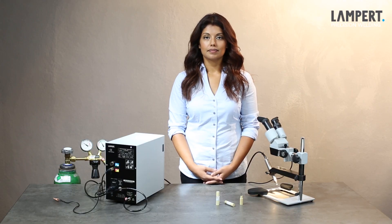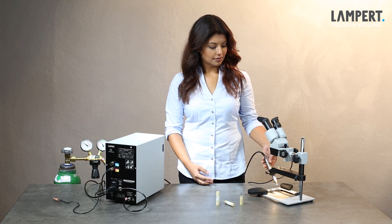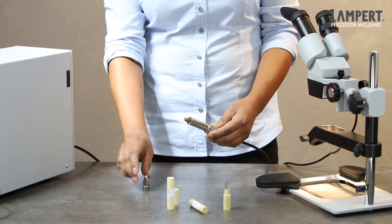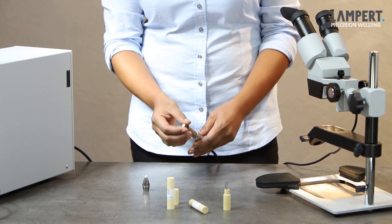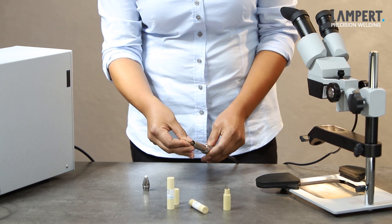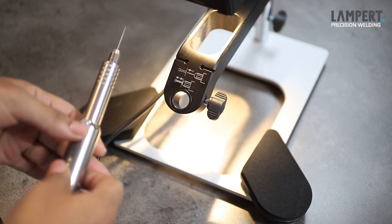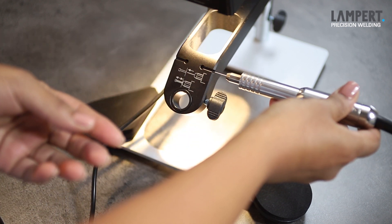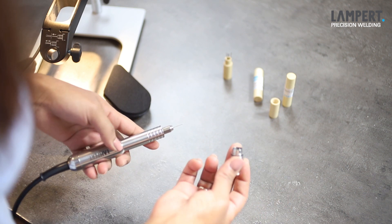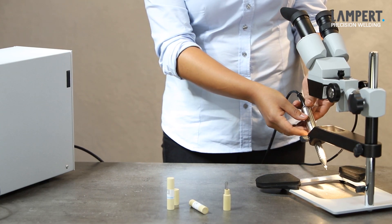Let's put in an electrode. I'll show you the correct procedure for that. They're all double-ended. They are sharp. Be cautious. Take out the handpiece. This front nozzle we simply pull off and set aside. It is not screwed. Inside here we have a chuck. Open it with some turns. Grab one of your electrodes and just pop it roughly into place. On the holder we've got two little slots, one on the right hand and one on the left hand. This is to ensure that you get the correct length of the electrode protruding from the handpiece. So don't fasten it just yet. Put it quite loose. Put it onto the groove and push up with your handpiece so the handpiece touches the side of the holder. That is now the correct length. Then simply hand tighten the nut. Do not use a spanner. Slip the nozzle and put that into the holder. And that now is all set.